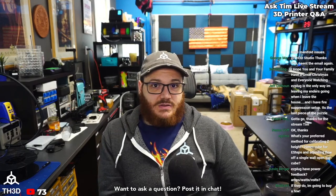That kind of stuff. So anybody who's telling you to calibrate your X, Y, and Z steps per millimeter has no idea what they're talking about, because X and Y are also determined by those same kind of factors. Instead of lead screw pitch, it's the diameter of the pulley that's on the motor. So those are static values. If you have anything else off like that, you would want to be doing the tuning in your actual printer's slicer, not the firmware itself.